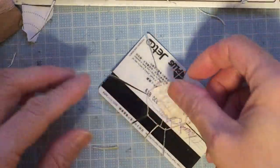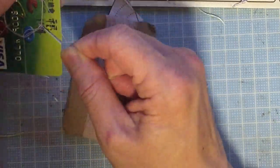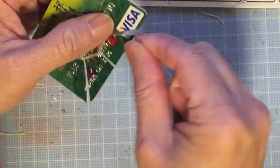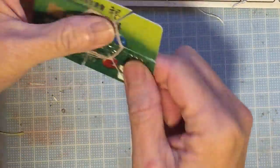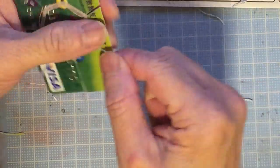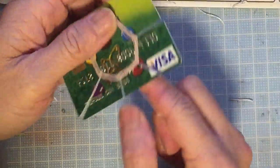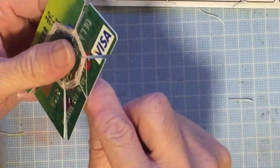The best is to use litz wire. I'm using a 12 strand litz wire, which means in one thread there are 12 different copper threads inside. Because of the skin effect, the highest frequencies tend to only travel on the outer surface of the copper. By winding with multiple smaller insulated wires, it maximizes the surface area, so the higher frequency will run over there, thus reducing the resistance.